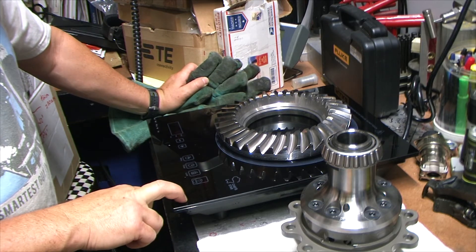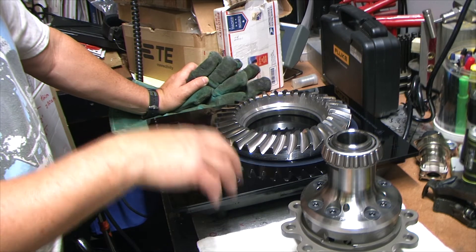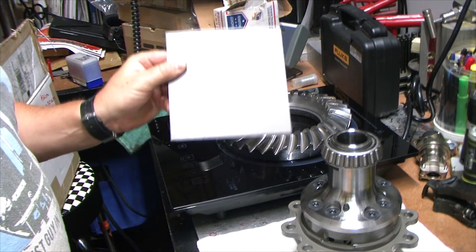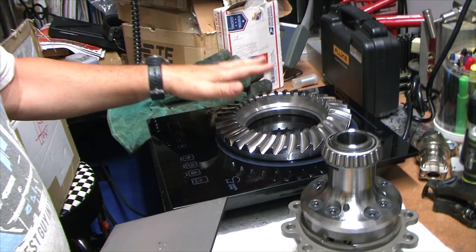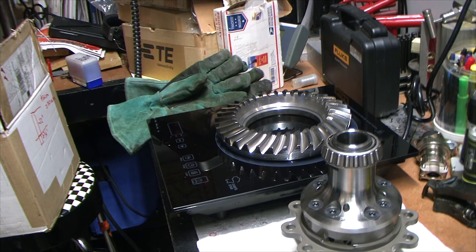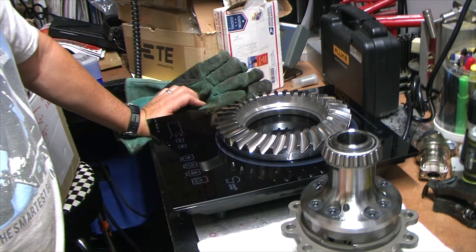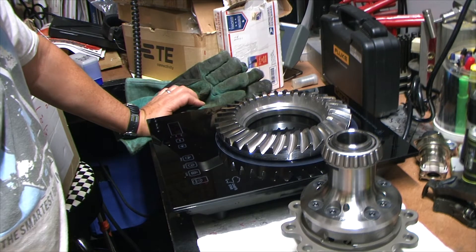As I said, I got this from Amazon for about $59 shipped. You can use it to heat bearings, but you need something a little larger than the bearing to trigger the sensor so it knows there's steel on it and will start to conduct. You can't turn it on without metal on it - that's the downside. For small bearings, you need a heater plate. They actually sell those for aluminum cookware, but that kind of defeats the purpose of the induction cooktop, since the whole idea is it heats through magnetism or induction.